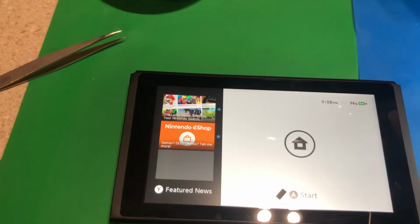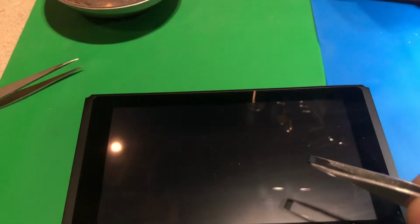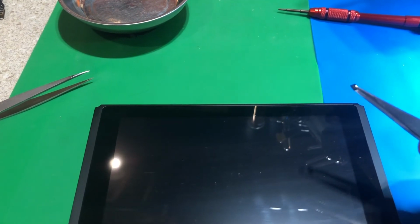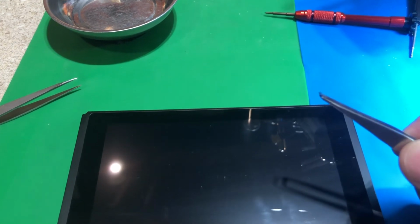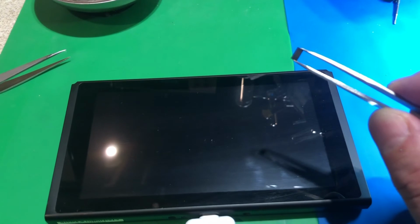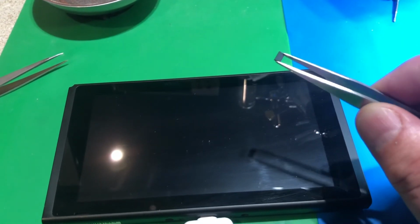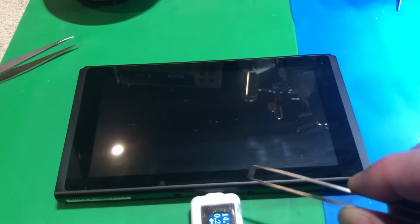The problem was this little chip here, which handles the switching for his video. This chip actually switches the video in and out of the USB-C port when you're using the dock. So the only thing I can think of is he had maybe a defective charger on the docking station, or it got ESD struck. These actually do not have enough surge protectors around them, like I see in Apple devices. Apple uses these really high-speed diodes that will short spikes to ground and stuff, and I just don't see that inside these machines. So you have to be careful with them, I would assume.